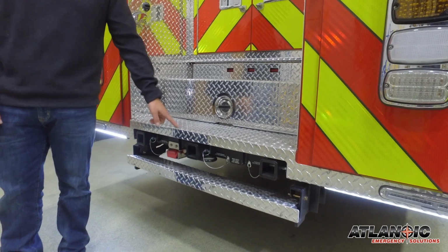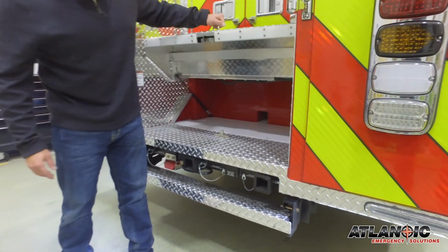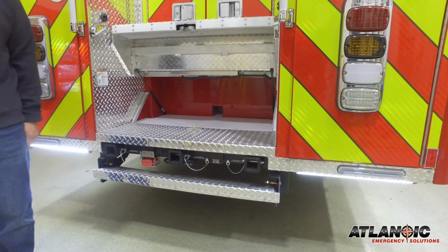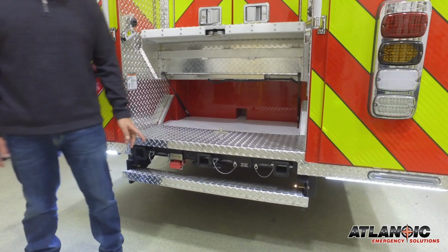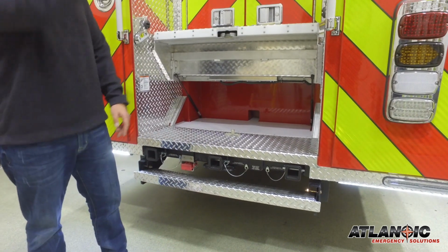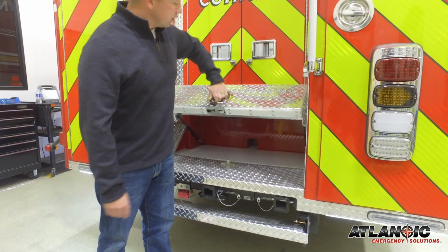We have our winch, our receiver hitch setups here. We can use either a remote winch, which would be stored in here, and that can be removed and placed into here. We have our electricity right there to be able to run it. We can also use these as anchor points for our 2-to-1s with using these winches, or we can use this for our monopod, which will then tie up to our anchors up there, so that we can do any type of high directional off the rear easier.